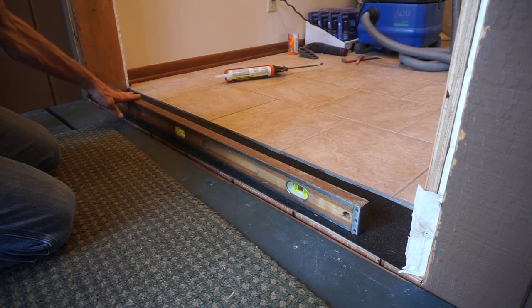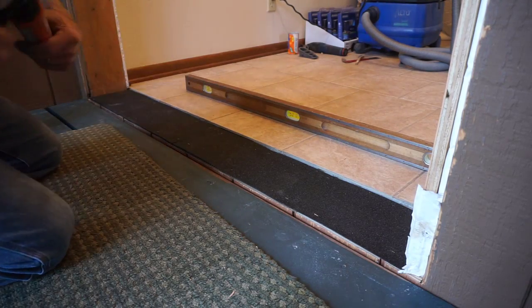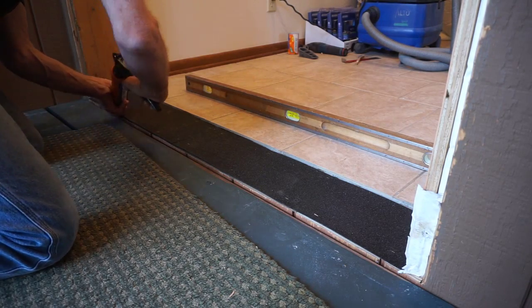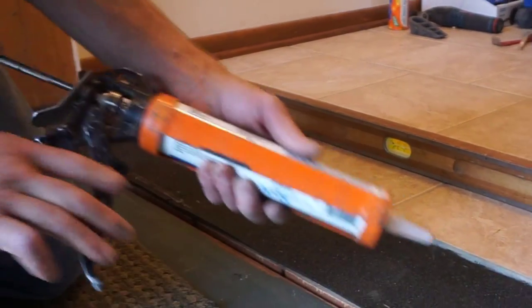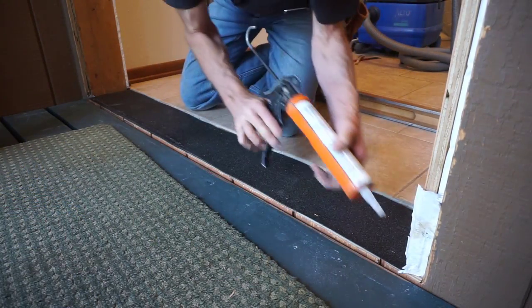With the subfloor shim nice and level, it's time to apply a bead of sealant on the edge and set the door frame. By cutting the tip with this reverse V notch in it, I can easily lay a plump bead of sealant at the door's edge.